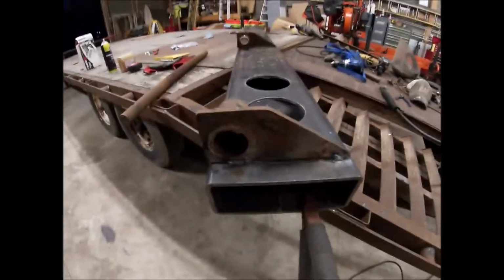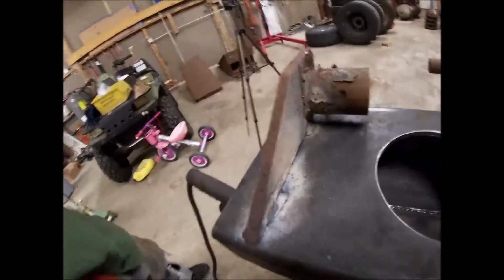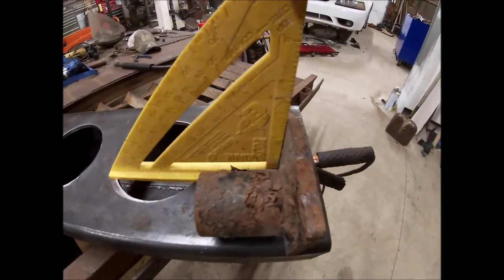One thing to make sure when you're welding: tack here, tack there, a couple tacks on the back side as well. That helps keep this bracket pretty well true, which it's true to the bore. You can see it's pretty well true to the angle too.